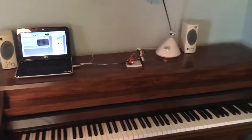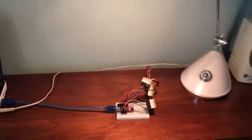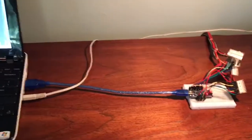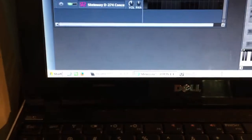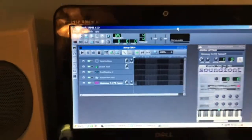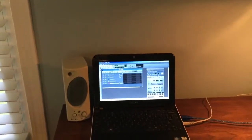I was able to figure out which notes go to which keys, and I'm running that through an Arduino Nano, then passing the MIDI signal over USB to an old netbook I had laying around. On the computer I have that running through Hairless MIDI and also loopMIDI for a virtual MIDI port, and then I'm using LMMS software with a soundfont that I found on the internet. I'll link below to everything I'm using and all the libraries.